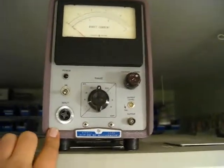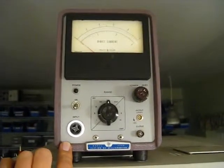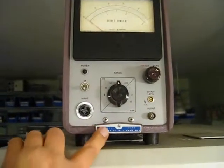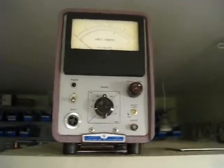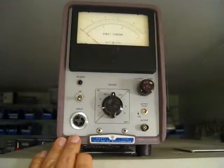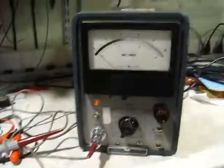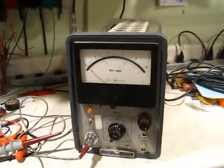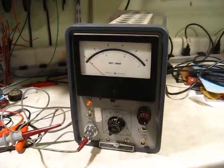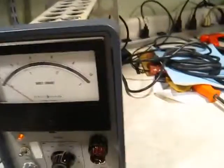The reason why this is important is that when you do debugging or tuning of tube amplifiers, you need to have a clip-on DC ammeter at the bias point. I got one of these — in fact I got two of them. Why two? Because when you do push-pull amplifiers, you need to look at the plate current on both output plates.